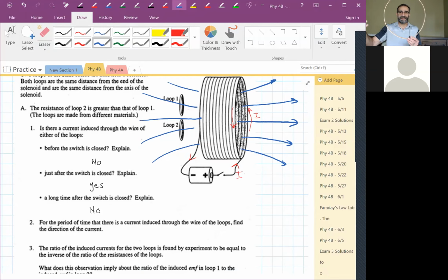Free energy. All we have to do is turn on a magnetic field, get some current to flow, turn off our magnetic field, and it'll just keep generating its own current forever. We know that's not going to be the case, right? You don't get something for nothing. So it must go the opposite direction. It's the only thing that makes sense. When a magnetic flux is turned on away from the camera toward me, the current must go the other way, because it has to create its own magnetic flux that opposes the changing magnetic flux that caused the current to begin with.